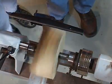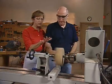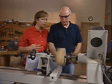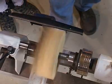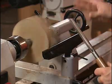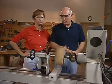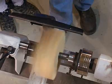Now, you're going to put your left hand on the tool, and we're going to start. And actually, before we start, this looks like a big chunk of wood turning quickly. Should I be afraid, or is there anything that I should be anticipating? The only thing, obviously, that's why you don't have long sleeves and loose jewelry, anything that might get caught. Other than that, it's really quite safe, again, as long as you start off at a reasonable speed. Okay. And we're around 700 RPMs for this diameter. That's very safe and should be fine.